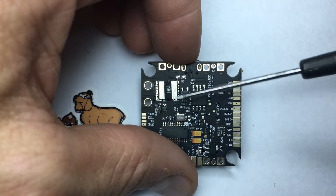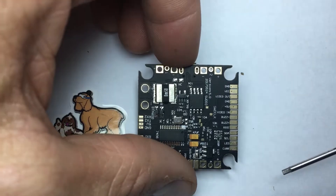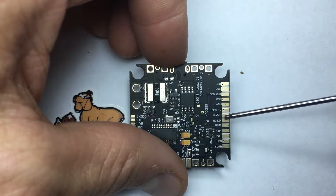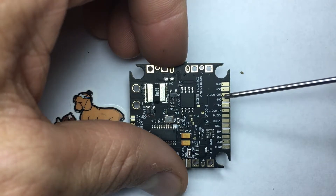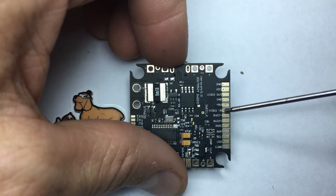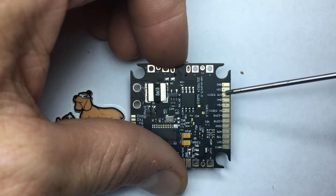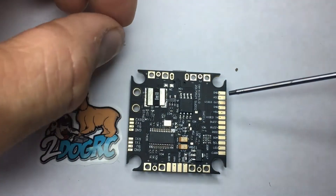Up this line, we've got current sensor — which you won't need because there's one on board. This is the LED signal wire; you can do controllable LEDs, the WS2811s or WS2812s. These two are for programming. Here's an RSSI. Here's your buzzer, positive and negative. Video in, 5 volts, ground, video out. The video in is your camera, power for your camera, ground for your camera. You should also ground here to your VTX so that the grounds are the same. Then here's ground and VCC, which you really won't need on this board if you're using it as a PDB.